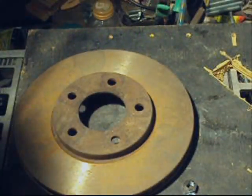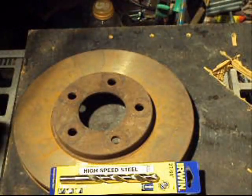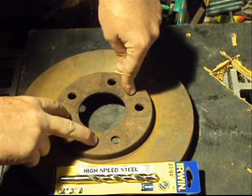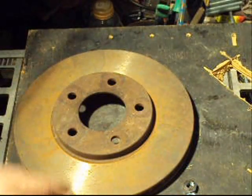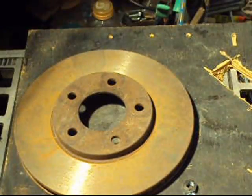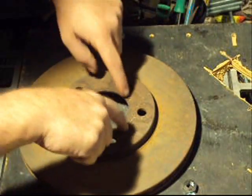Before we can put magnets on and cast them, there's other things we've got to do. Number one, this is a 27/64 inch drill bit — that has to drill three holes through here. The reason why you want to do this before you do your magnets is you don't want all this metal shavings going all over your magnets. So these three holes have to be drilled here and then tapped. I have a tap that's 13 threads per inch, half inch — it accepts the half-inch all-thread. And that's what we're going to use for jack screws.